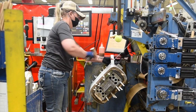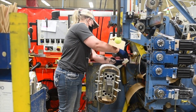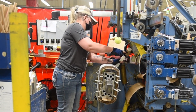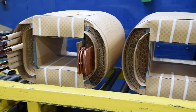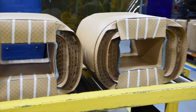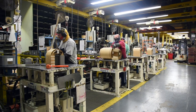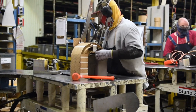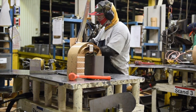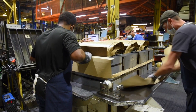Here's a quick view of a coiling machine in action. A coil contains a unique combination of paper, aluminum or copper conductor, and glue, which is wound as per our engineering design. This process step is called core coil assembly — this is where the heart of a transformer takes shape. It combines our coils with a core within a metal insulated frame, and this becomes what is known as an active part. In internal assembly, we hook up the active part to the external components of a tank. This process takes skilled employees that can read wiring diagrams to produce a functioning transformer.